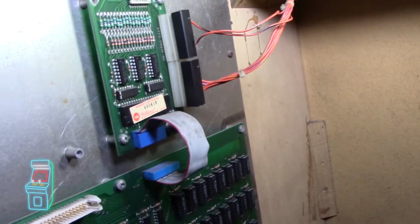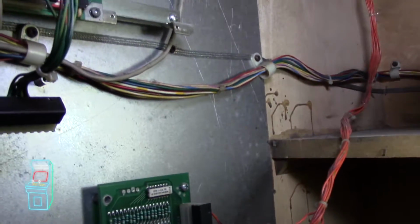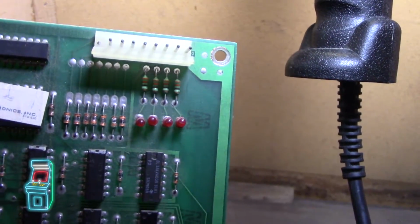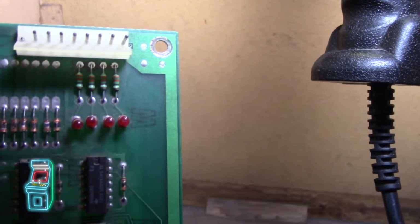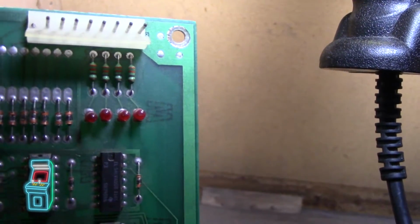And then the problem I'm getting now, usually there's like 4 indicator lights. Let me see if I can find it here. I can't recall. It might be on the ROM board actually. Yeah, it is. So I have the ROM board in my hand here. I'll just take it out. So there's 4 lights. You can see it right there in the upper right-hand corner. Those lights usually flash a couple times and give different messages. Well, on mine, when you turn it on, they're all lit, and they don't turn off at all.